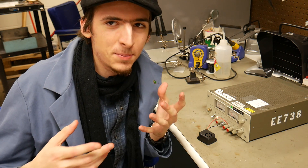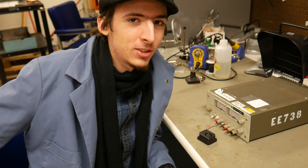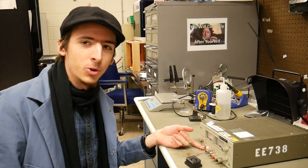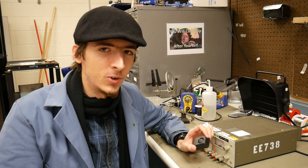Maybe I'm thinking too big. The ideal thing to use is the most powerful speaker that I have — and that's this. This little guy is one of the most diabolical speakers on the planet. It happens to be a 102 decibel piezo siren. This little siren requires about 12 volts DC in order to work. This is the kind of speaker you would find in a fire alarm and it's just as loud. 102 decibels.